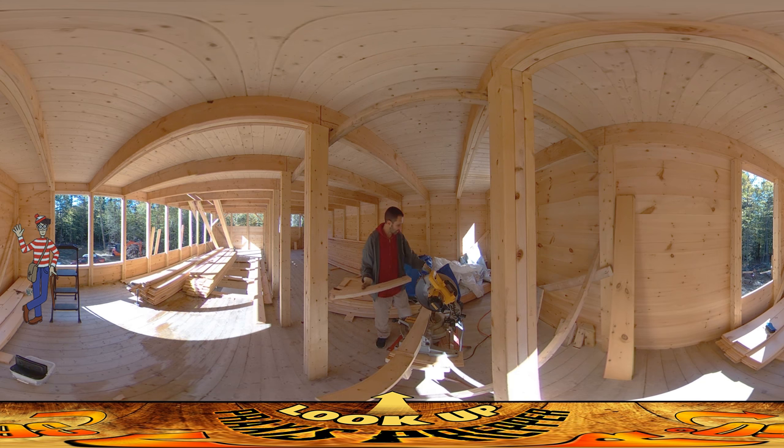I've got a couple of randomly sized boards laid down on the table, with the ends lined up flush on the back side. I'm taking this piece — which is the length I want — and putting it on top, feeling along the side with my hand to make sure it's nice and flush. For a really tall stack you'd want a carpenter's square, but for just a couple of boards you can just feel it with your fingers. Then I lower the blade until it just touches the top board, get it all lined up without pushing against the blade, and now I'm going to cut through.